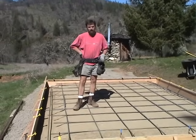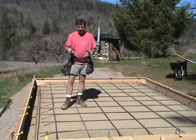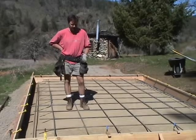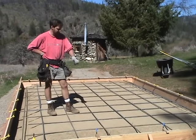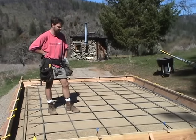I've gone ahead and made a grid of rebar here on top of the slab. We've got an 18-inch center — 18 inches in each direction is the measurement for this grid. I use the same method of attachment using those twisters to attach about every other space. I don't attach every one; it's a solid grid in and of itself just with every other space tied together.